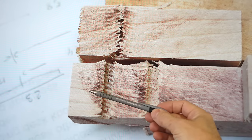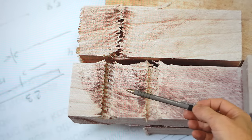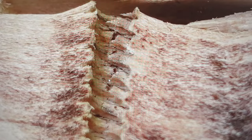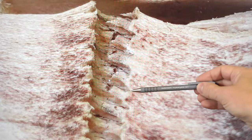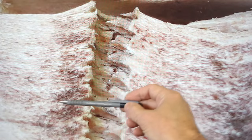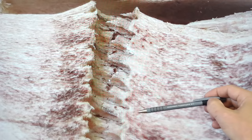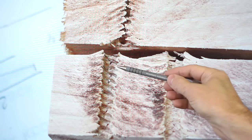I cut open my piece of wood to have a look at what's going on. If we have a really close look at that, you can see how the fibers really curve up around where the thread is. So the failure isn't so much the thread shearing off, but the surrounding wood kind of bending and failing that way. And given that, it's no surprise that the actual thread depth didn't matter that much.